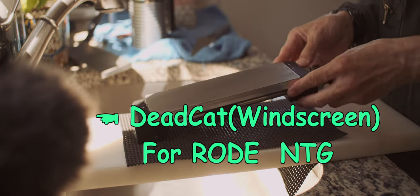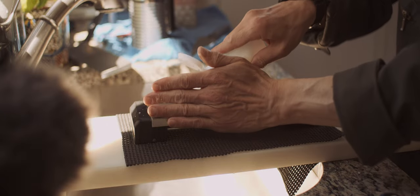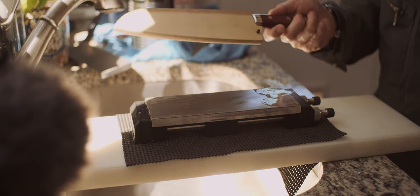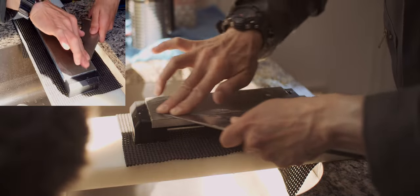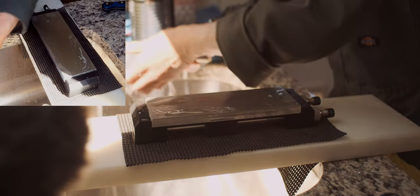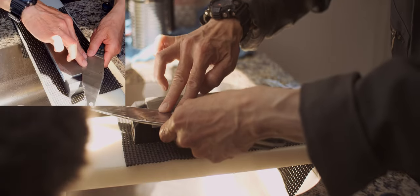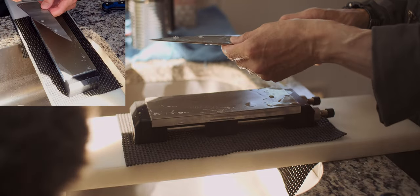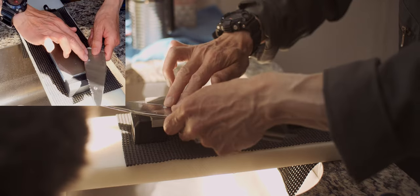When you do this kind of project, modifying double beveled knife into single beveled, you have to know certain things. The number one is something like this. Thin blade stock, laminated construction, you cannot do it. So when you modify to single beveled, when the blade stock is thick enough and it is a monosteel construction, then yes, it can work.